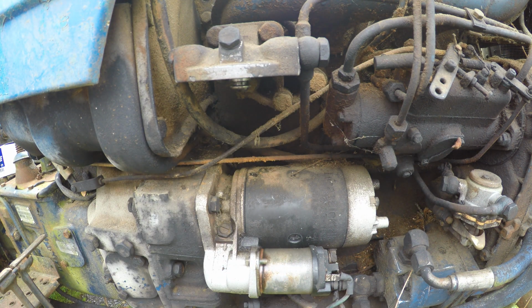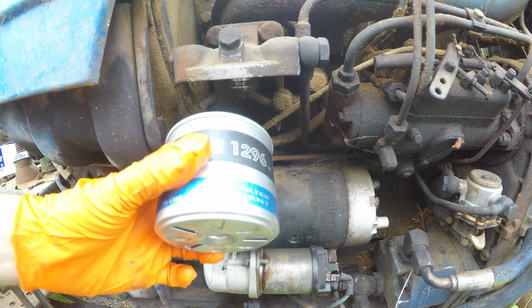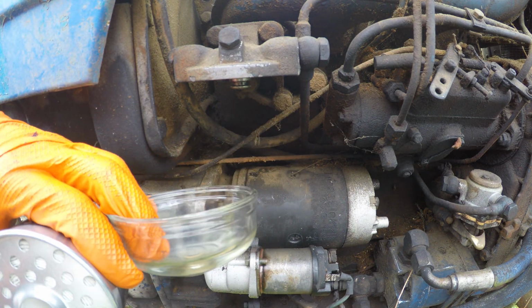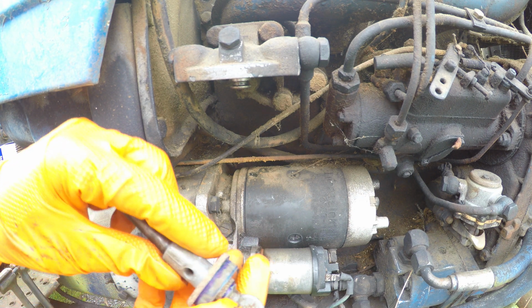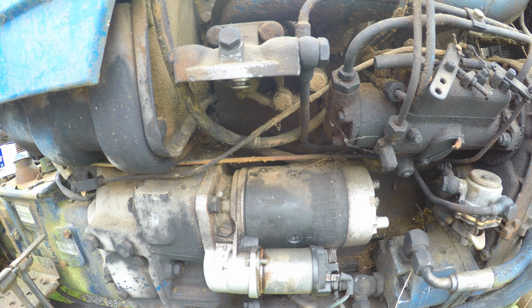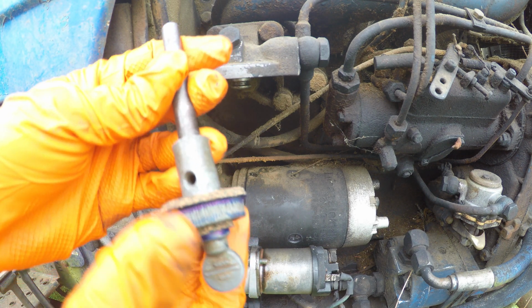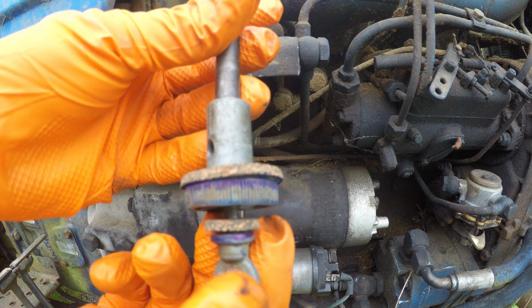And it's very simple. I didn't film taking it off, but this is basically all it is. Filter, and on these Long tractors, at least, a glass bowl. These have O-rings in the middle. And then here, at least for this kit, 711-296. I believe it's CAV296 as well. Anyway, it does not come with this right here, the drain screw. This might only be a Long type filter. I don't know. I'm not really big into tractors.